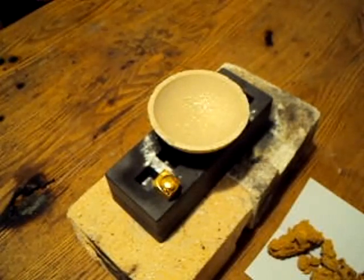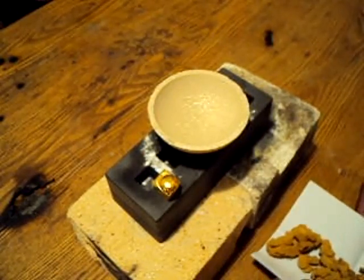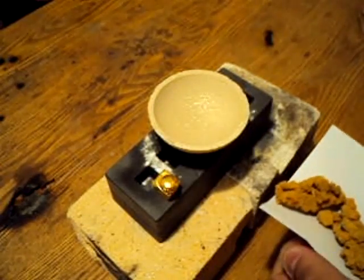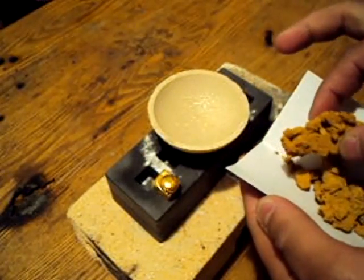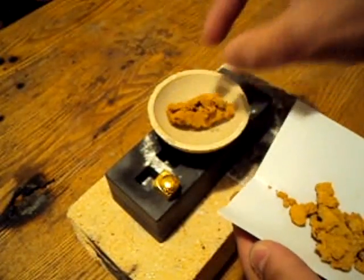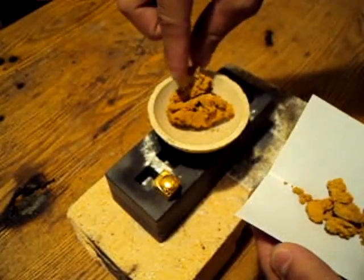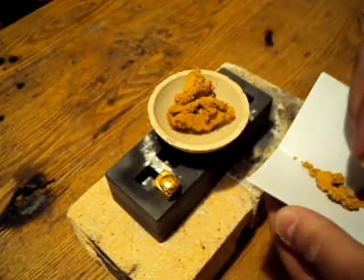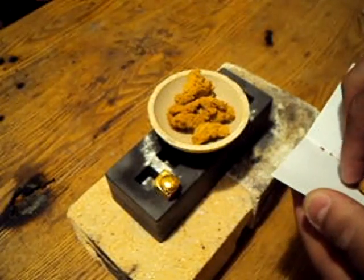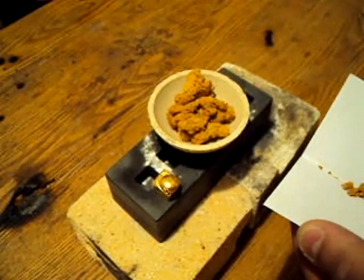Okay, we're back. I just got done coating the crucible with borax to give it a nice glaze. I'm going to go ahead and add the gold powder — this is 66 grams, which is a bit too much to put in all at once. I'm going to take the big clumps first, which will be a little easier to melt to get started. Then once I get that down to a molten metal, I'll add the remainder, and then I'll add the already melted 24k gold.